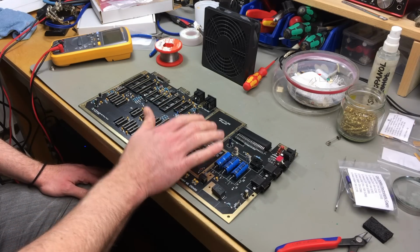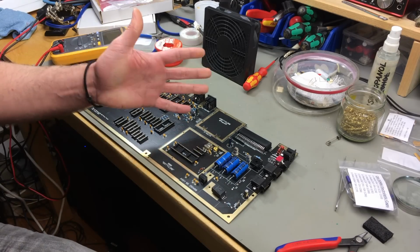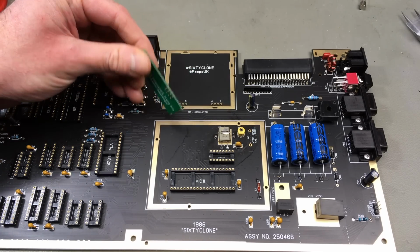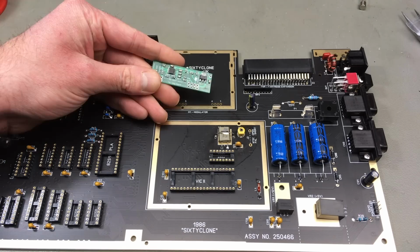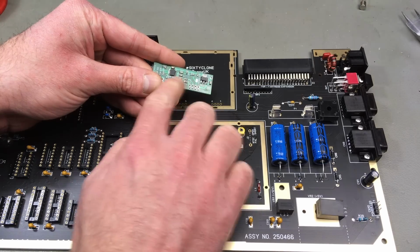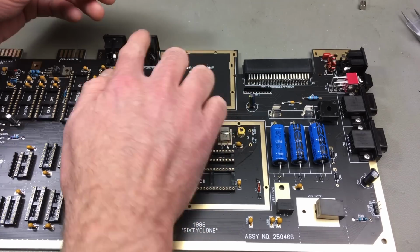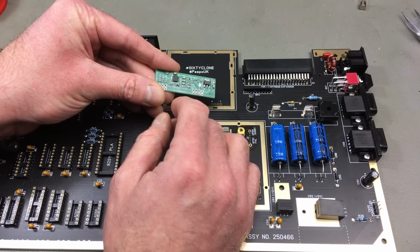Okay, one last thing to solder in is the RF modulator. However, I'm not going to use an RF modulator because who uses analog television anymore? And the RF modulator deteriorates the video signals anyway, so I'm going to use this little board, which is actually made by Copper Dragon, and it's available on GitHub, so you can make your own if you so desire. It's basically the little part in the component mod that I've made a video about that also was designed by Copper Dragon. This is the part replacing the original RF modulator circuitry from that project basically. This should give me the normal video output on the audio-video jack here and not give me an RF output, which I don't need anyway. And this is going to have the best possible signal quality.